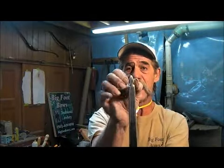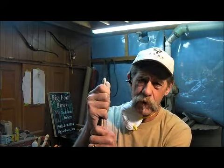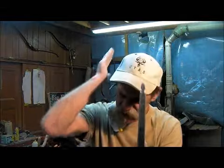It's real easy, if you get your string groove off just a little bit and then take the limb over and center, you lose your center. If you got your string groove off just a fuzz and then you brought your limb over to match that notch, well then your bow's going to be out of line and you're going to get a slight twist to it. Which is really critical on a longbow with a deep core. But if you start doing this on a recurve limb, it's critical that everything is just dead center.